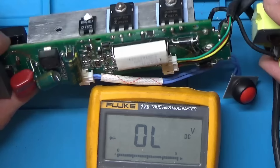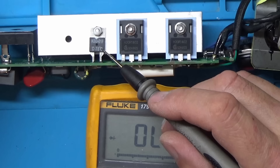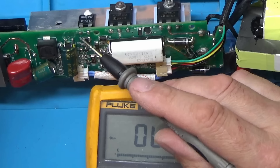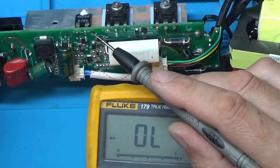I'm just wondering if that is a thermal fuse. I'm going to have a look and see what this is before unsoldering it, because if it is a thermal fuse that doesn't make sense actually - it can't be a thermal fuse. It must be some kind of temperature sensor, because if it was a thermal fuse, how would you solder it in? The solder temperature would be more than 75 degrees. I think it would be all right to solder, so I think it must be some kind of temperature sensor.